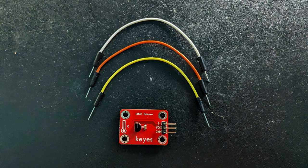Let's first read the raw data from the sensor and print it out to the serial monitor. All we need is the sensor and three jumper wires. Before you hook anything up, here's a warning to avoid a mistake I almost made that could burn out your sensor. Your jumper wire placement depends on the type of sensor you have — a standalone sensor is going to be different than the sensor module I'm using. I automatically put my jumper wire to the middle pin, and then it got crazy hot, burned me, and gave readings hundreds of degrees higher than the actual temperature. Turned out that on this module, that pin is very much not the middle. Make sure you place your jumper wires according to your specific sensor.